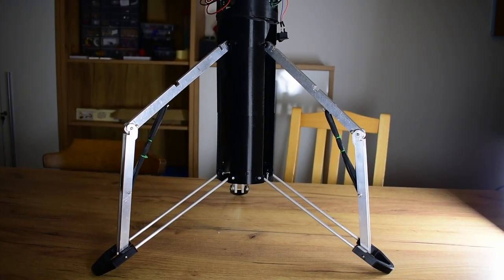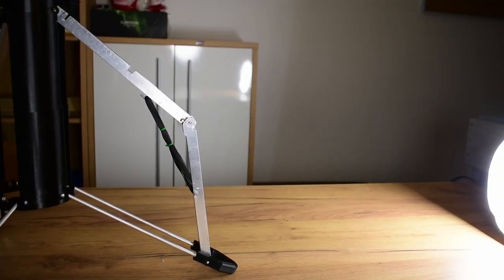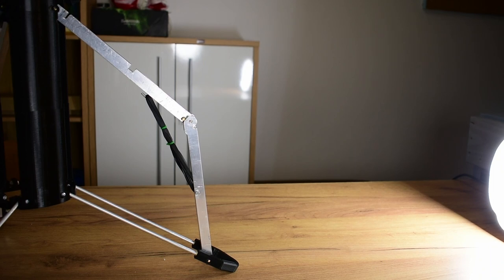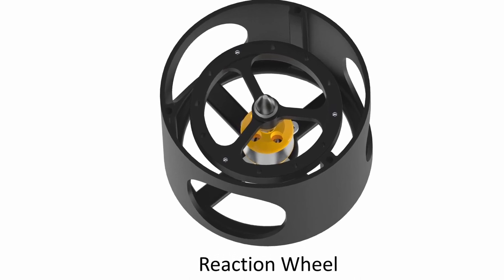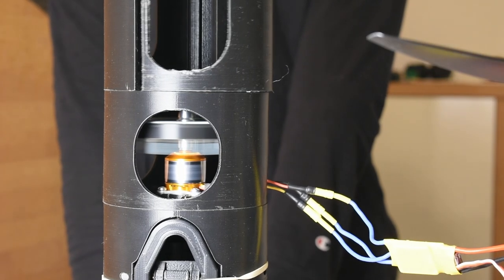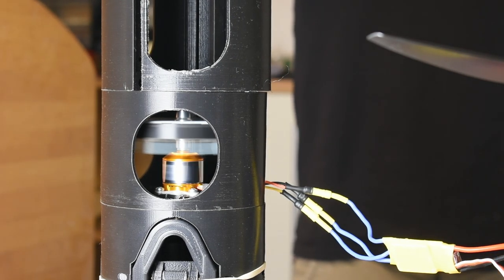Because our current focus is on getting the parachute landing done first, we have yet to design the TBS or TVC. As a brief side note, we already had to change the new landing leg design several times over the last couple of months — it is now fully made out of aluminium to withstand the impact forces. The next module we implemented for the first time ever is the gyrowheel module, which should help passively stabilize the rocket in the yaw and pitch axes and maybe actively control the roll axis. To achieve that, we basically use a flywheel attached to a drone motor that spins very fast.